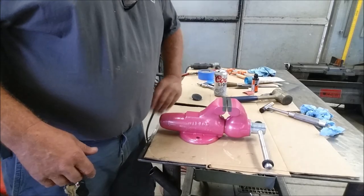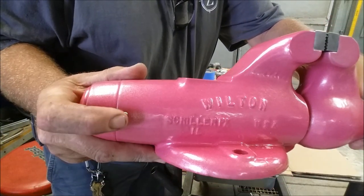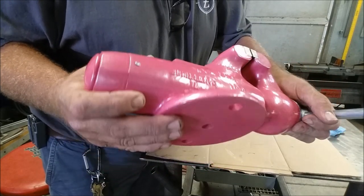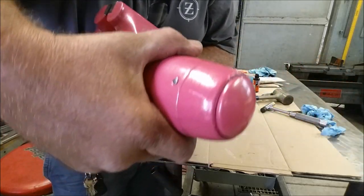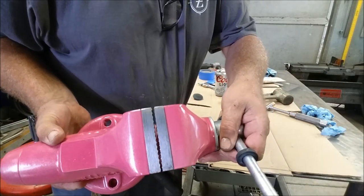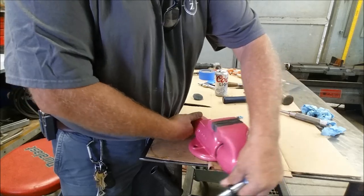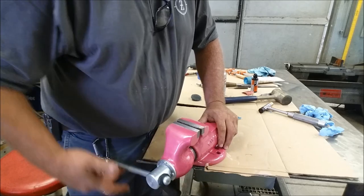Okay, well, the vise is all back together. You can see on the end cap, the pins that go in there, it's like a dowel with a face spline, if you want to call it that, or just a kind of a straight knurl. Anyways, I ran the ends of them over a burnishing wheel and polished the ends up and tapped them in with a plastic hammer. Gave the jaws a little bit of polish. They're looking good. Everything else was already pretty new. I cleaned all the lead screw and took any powder coating out that I found that was in the way of the mechanism, but it operates very smoothly.